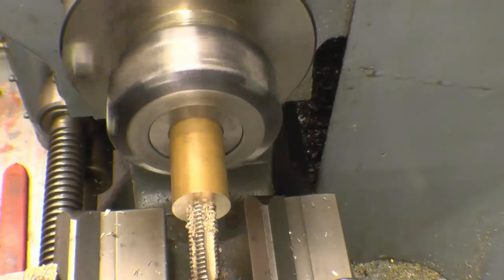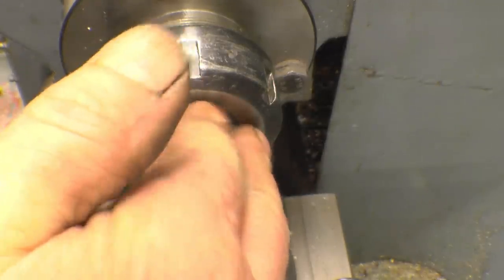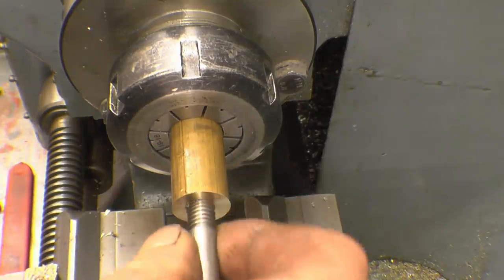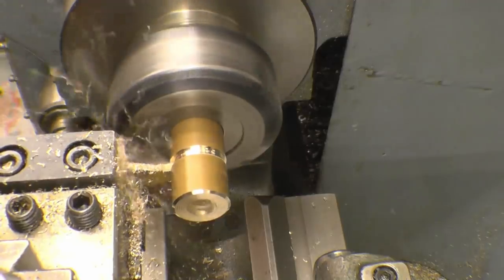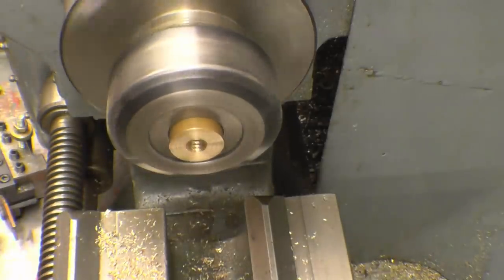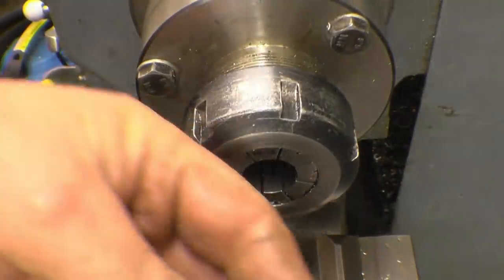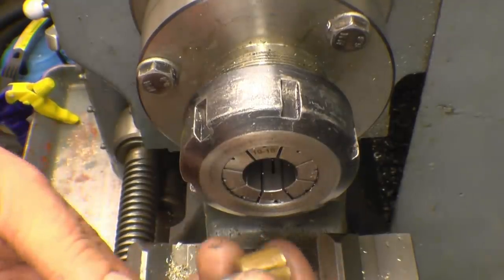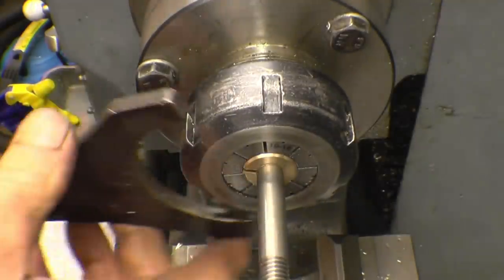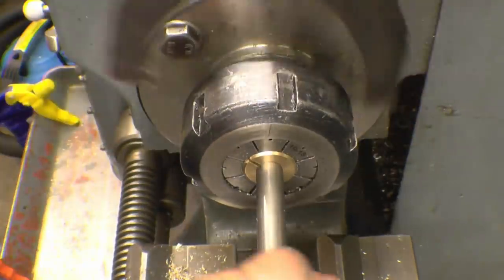I was looking and I've got a large collection of Whitworth taps and dies — full stock, but they're all brand new, old Dormer press tools. All decent stuff. So that's now tapped 3/8 Whitworth. We've got a little brass collet that screws onto there, into the chuck, tighten that in, and roughly that should grip that nice and solid and stop it from turning just by squeezing the brass collet. It certainly appears to be doing that.